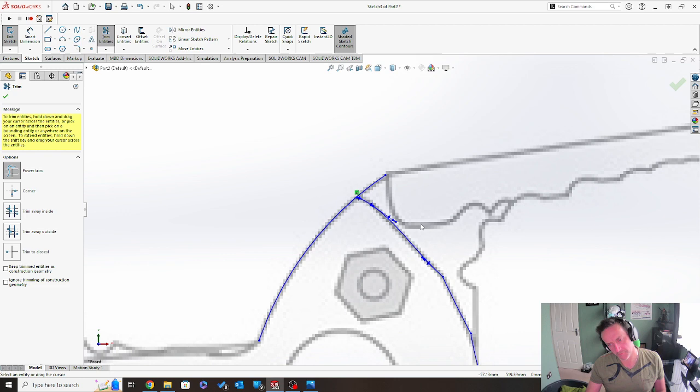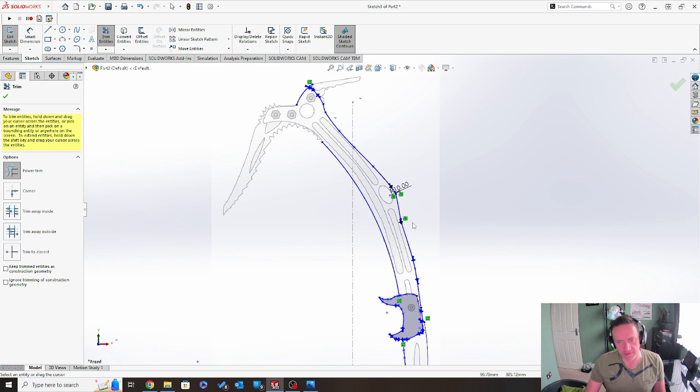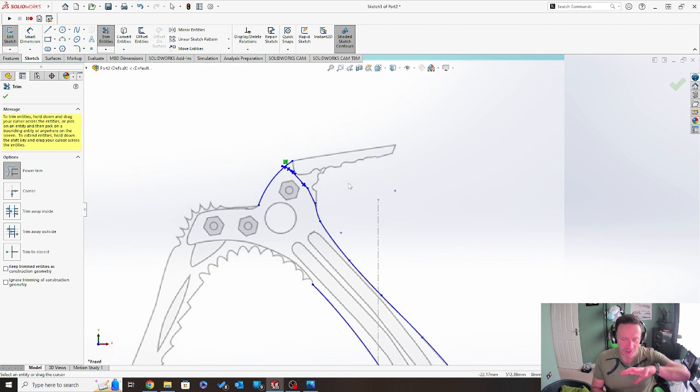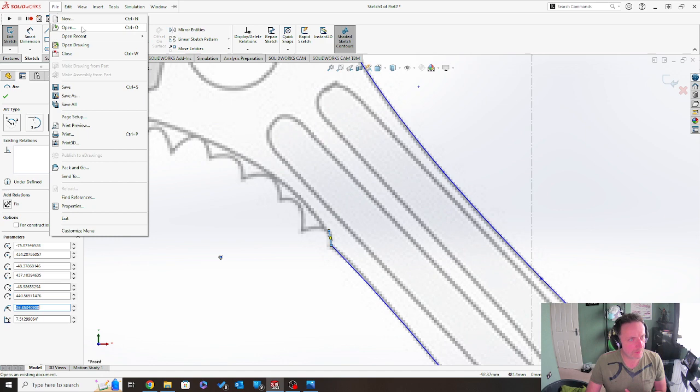Okay. So we're almost now at a position where we kind of know where everything's going to be. There's these inputs, these dents, these cutouts. But what we'll do is use this as a master sketch. And then it becomes really good. It becomes so much fun because we can extract surfaces left, right, and center, and it starts to really look like the part that we're after. So I've got a 3-point arc. This 3-point arc brings it into this edge here.